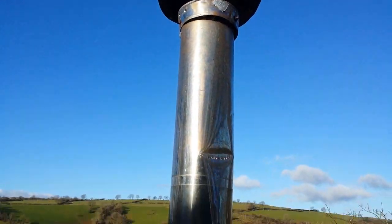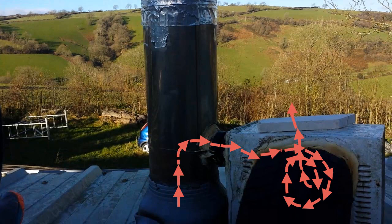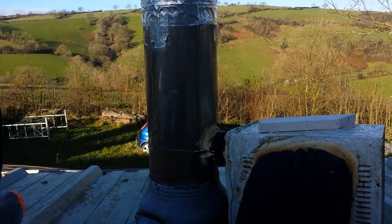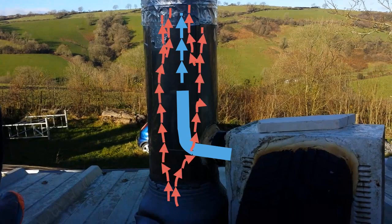While we're here I might as well talk about how the fan works. In the past it drew the hot air out and went through the fan, spun around and then shot out. That worked quite well but the fan blades kept getting gunked up with creosote. So I spun the fan around to blow air into the flue through a stainless steel pipe, blowing air from the outside straight up the flue. The idea is that the venturi effect would pull the hot air from the stove out and up and away.